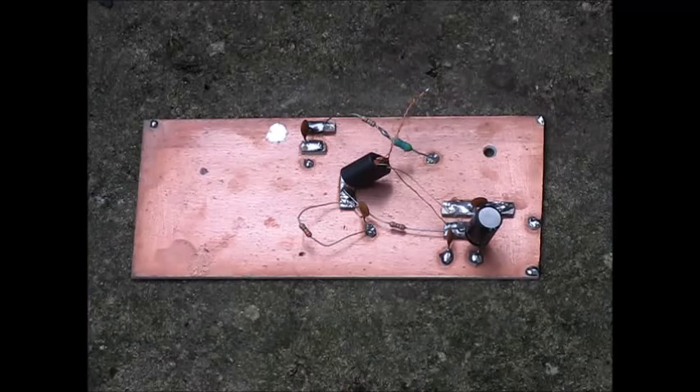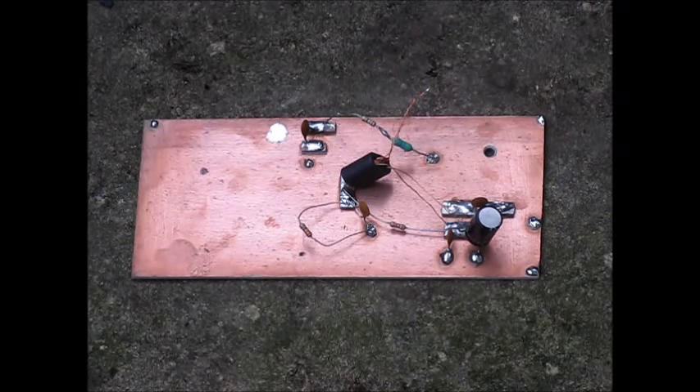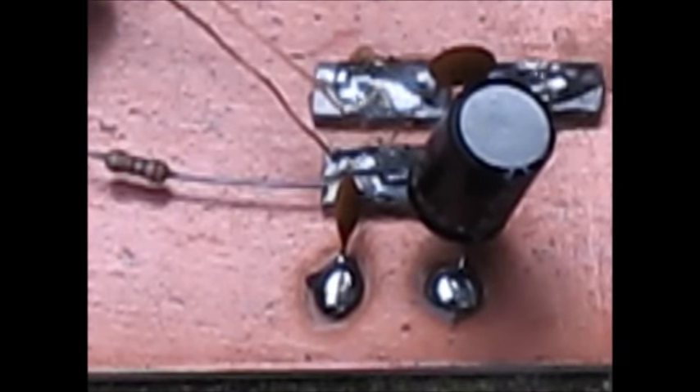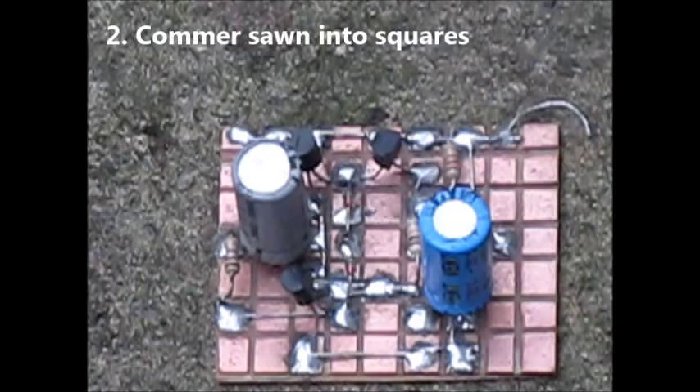Back to work, Dave. So what are your construction alternatives? You could just use a blank printed circuit board with the earthed parts of the components soldered straight to the board, and small pads used to hold those that aren't earthed if you want some mechanical stability. Provided you keep leads short, this is a good approach for building circuits with discrete components.